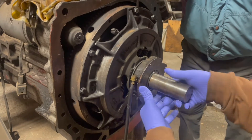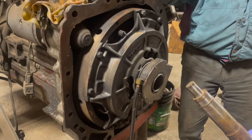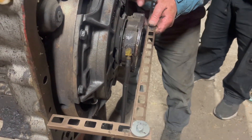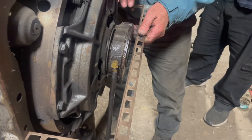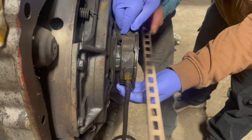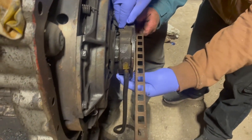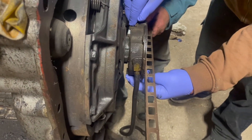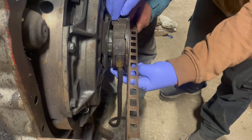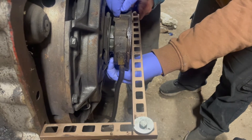We'll pull out the pilot shaft we used and it came out nice, so everything felt like it was lined up pretty good. Now we're ready for adjusting. This is a pull-release bearing, so you're going to pull it out. We've made a test jig for clearance and we're supposed to be at 5.418 inches out, and we're pretty close — we're just in a bit.